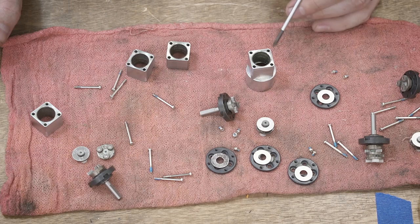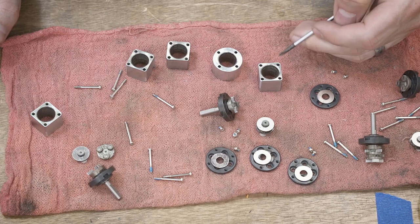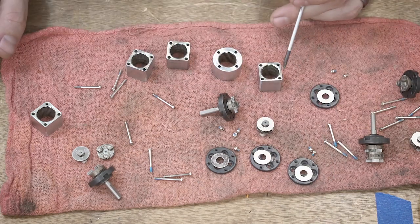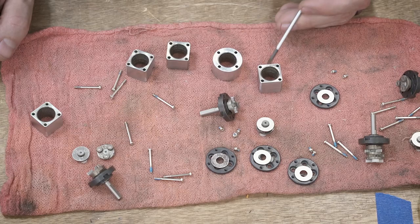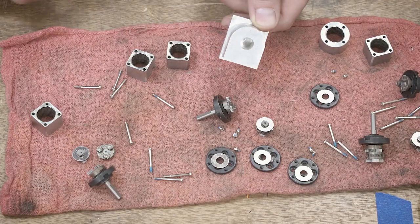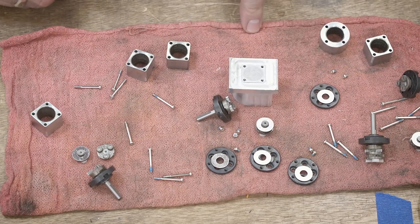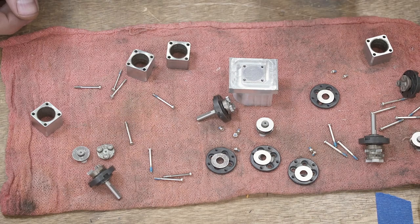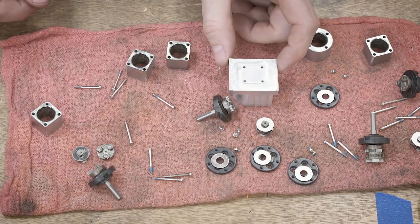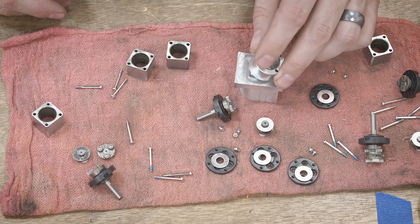All I'm doing is removing material from all sides. In SolidWorks I'm basically just making a 16.5 millimeter square and cutting everything else off the sides. It's a pretty simple operation — we just need to figure out how to hold this and actually machine it. I had this little piece of stock left over — this is actually one of the wedge mounts for Crippling Depression — but it was a good size and just something I had sitting in the box.